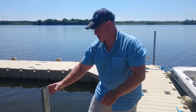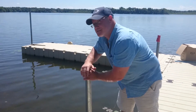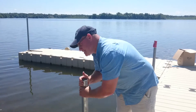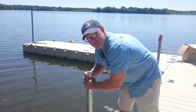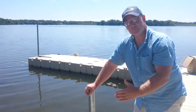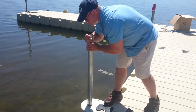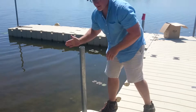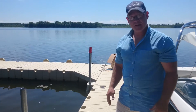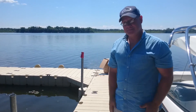Now we're going to take this and seed it in. Here's something else that's sometimes frustrating because you may run into a rock. So very often we'll search around and try to find a spot where there aren't any rocks. That's why it's handy with EasyDock because we've got about every 19 inches we can move left or right or forward and back to find a spot that works well. We'll get that seated, come back after and tighten that up once all the other pieces are in, and once the dock is aligned the way the customer wants. And that's how you install a pipe bracket.